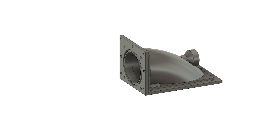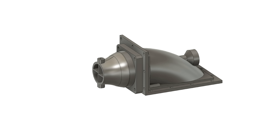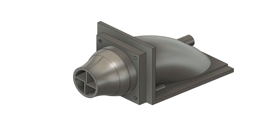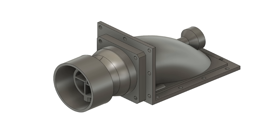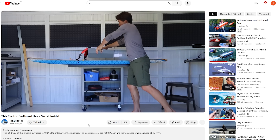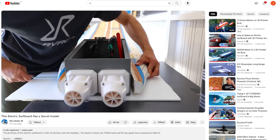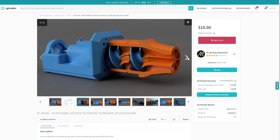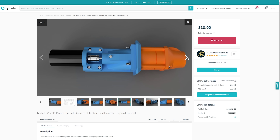Most waterjets have four main components: the housing, which is connected to the boat and mostly inside it; the impeller, which moves the water and is connected to a motor via a shaft; the nozzle, which shapes the water stream; and inside the nozzle there's also a diffuser. There's also a bucket for steering. I'll show my own basic design and also a more advanced two-stage jet drive I found on the RC Life On channel.